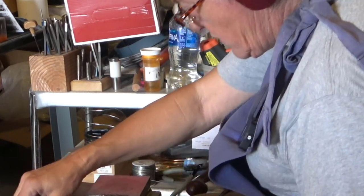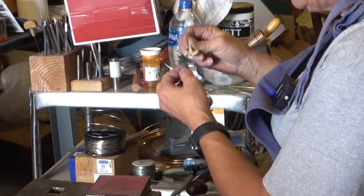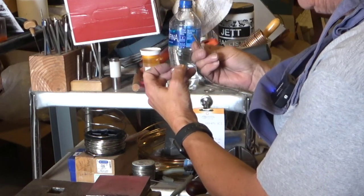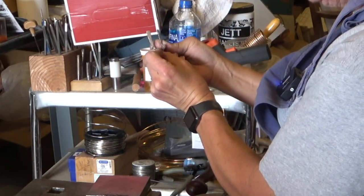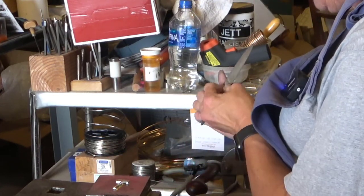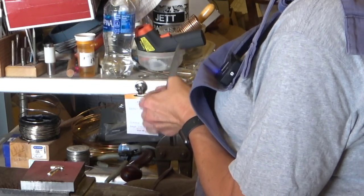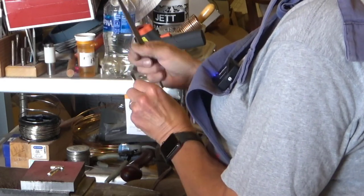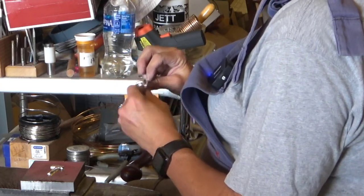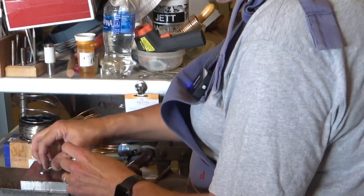Now you can see what I've done — this is the way it starts out. It's a little rough here because this is not a perfect cast piece. I've hammered it flatter, which makes it shinier. And then I've hammered this part from the side, which broadens it out. I'll shape this on the wet wheel. I could do it with a file here — won't hurt anything. There we go, I just rounded that a little bit. I'll mark it with a center punch so that the drill bit won't skitter, and I'll drill a hole through there. Then I'll take it on the wet wheel.